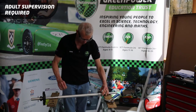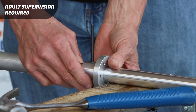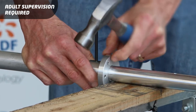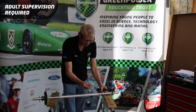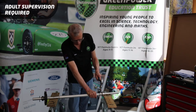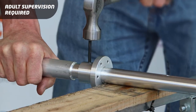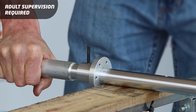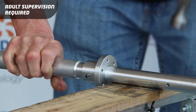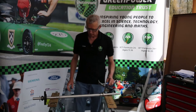That's started the pin in the disc hub but I need to make sure it's lined up with the hole, so I'm going to come up through my disc hub and through the axle. With careful use of hands I can actually keep those lined up while I then tap this through. Now I can take my little Allen key out of the way because my pin's gone through far enough — it's entered the hole in the axle and I can carry on pushing that through. You can see it is going; it's not come out the other side just yet but it will do. Now it's just starting to come out the other side and like the other end of the axle we want this to be equally spaced either side. That's our disc hub fixed to the axle.